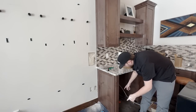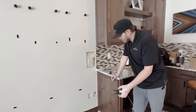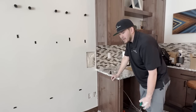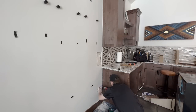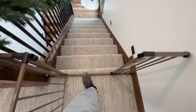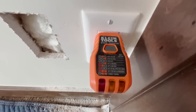I've relocated my power from the old location to the new one. Now I just have to strip everything back and terminate the ends. Power wiring is simple: black is hot, white is neutral, and you have your ground — all three are required. I've covered relocating outlets in past videos so I won't go into too much detail here. Let's kick the breaker back on and make sure everything tests correctly. Two yellow lights — that means we're good and everything is wired correctly.